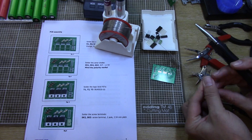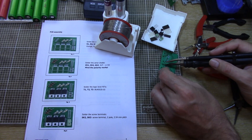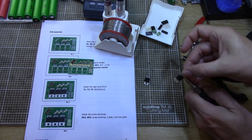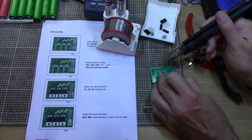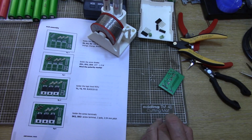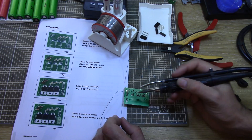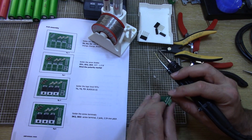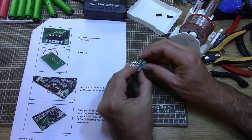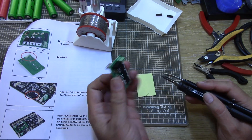I use a ridiculously fine 0.38 millimetre diameter solder — I thought it was a good idea when I got it but you just have to feed so much of it onto the joint that it's a real pain to work with. There are three MOSFETs that control the switching on and off of the red, green, and blue LED strips respectively. Then trim all the ends off, tidy up the solder joints, add on the screw terminals, a bit more soldering, and then add on the six-pin headers. Check the soldering again — job's a good'un.